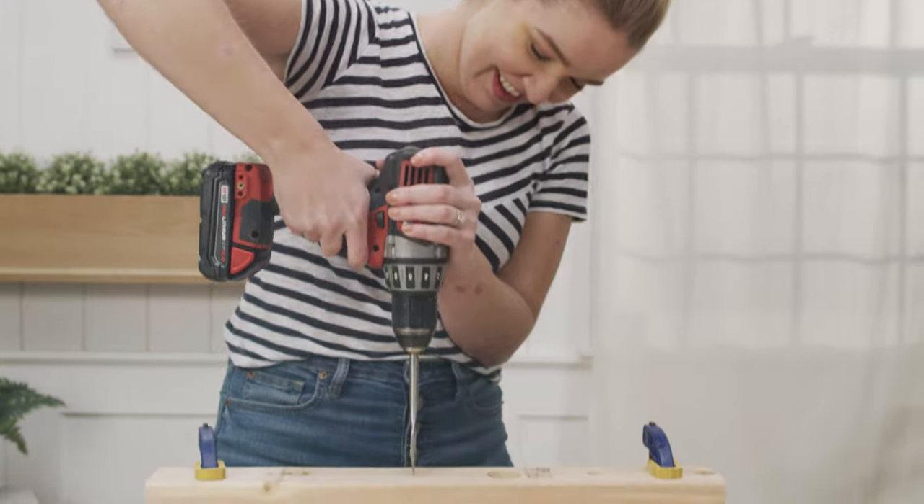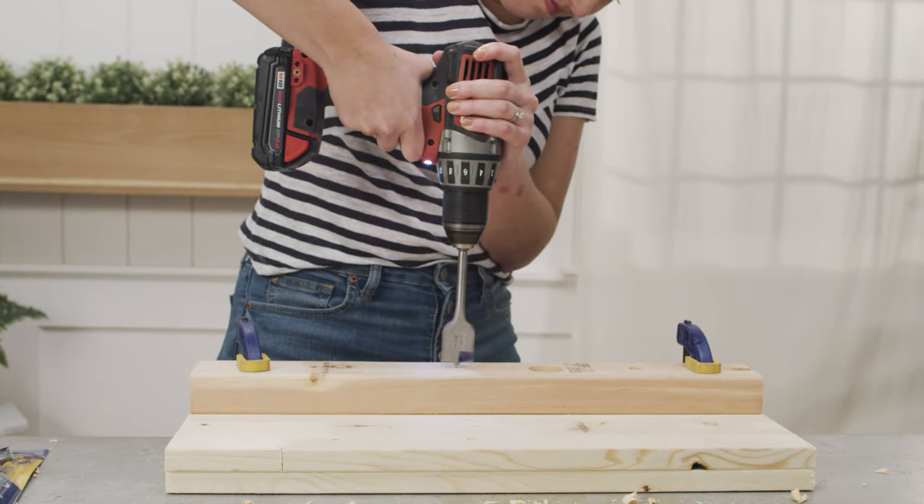Because the middle point of contact is so important, it's pretty much impossible to make an existing hole larger with a spade bit, unless you have superhuman strength. A larger spade bit — one with three points — takes a little more skill than using a twist drill bit. Because spade bits can be larger than twist bits but have fewer contact points when getting started, they're more prone to getting stuck or creating kickback. Protect your wrist by bracing your arm against the drill while drilling.